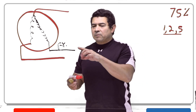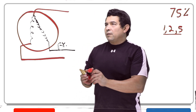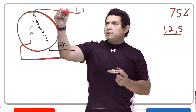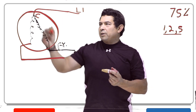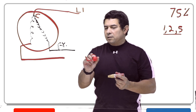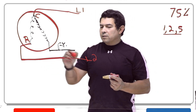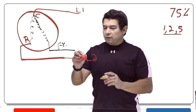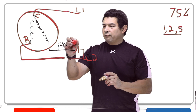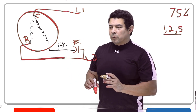Another way is, if you have a fan motor, this is going to be a brown wire. Typically you're going to have, for example, L1 that feeds your common connection. Then you're going to have L2 that feeds your run winding. And the same line that feeds the run winding is going to come over and feed your run capacitor.